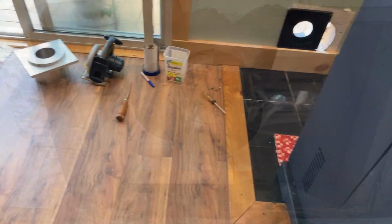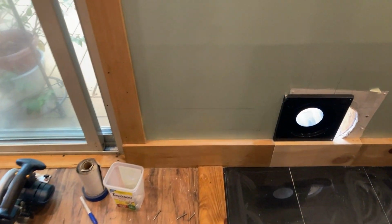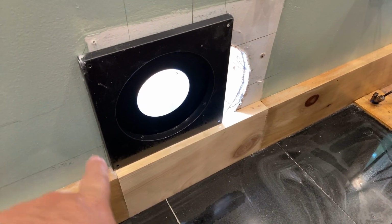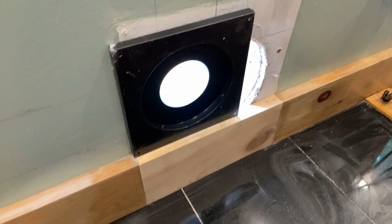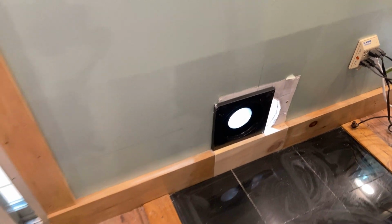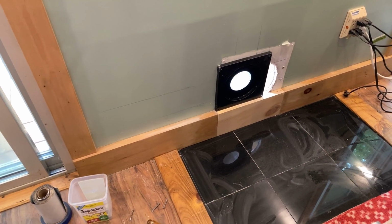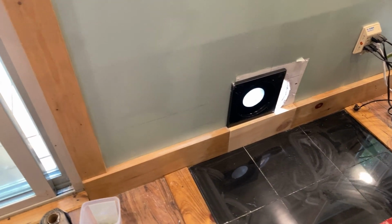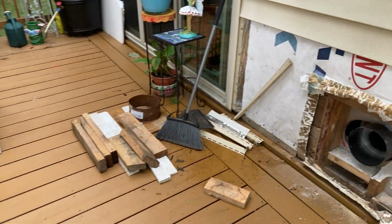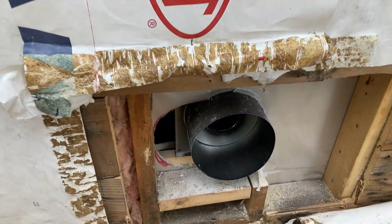I'm gonna move the stove back, but so I put in baseboard, cut a piece for baseboard, and then I mounted that there. And that'll be cool if that sits right. Otherwise, I gotta notch the baseboard. Or I put the stove back in position and adjusted the thimble accordingly and marked the, it looks like I do have to drop the thimble down a little bit. So I marked the baseboard accordingly.